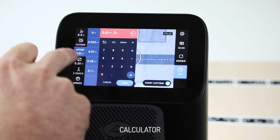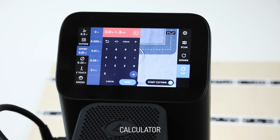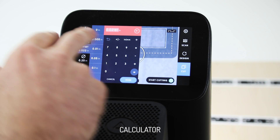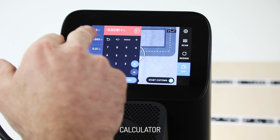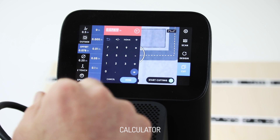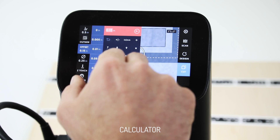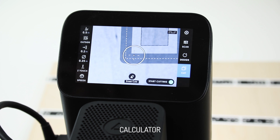If I choose millimeters, you'll notice we can have non-homogeneous units at the top — so 0.01 inches plus 0.3, then hit done, and that becomes a decimal so we can cut with that. There's also the ability to make that negative, so I'm now toggling between positive and negative. We can do things like add a preset: negative 0.02 plus 0.1. So if you've got presets that enable you to step through values that make sense, it's very powerful.